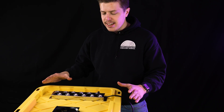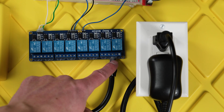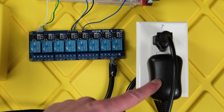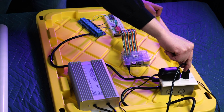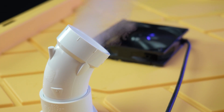We obviously don't want these things running all the time because our house would be very moist. So to control these things without us plugging and unplugging, we have a Raspberry Pi connected to a temperature sensor, and Jack made a program that when it hits a specified ratio will trigger this relay, which completes the hot wire circuit in this outlet. Connected to the wall and plugged in is the fan as well as the 400-watt power supply for the ultrasonic atomizer, which allows this to function without us having to interact with it at all.